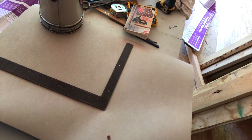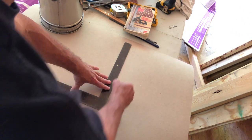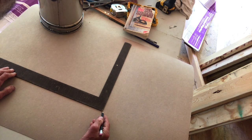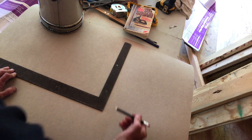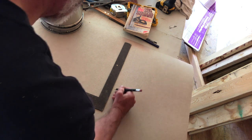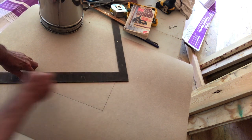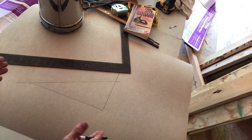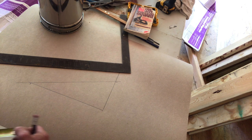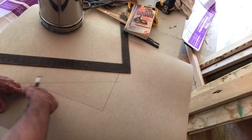All right, we begin with a piece of scrap paper or cardboard. Draw a line on your paper using your square. Mark over 12 inches — that's always 12 inches. Next, you want the pitch of your roof marked on here. In this case, I have a 6-12 pitch. I'm marking on the outside — I come up 6 inches. Now I'm going to take the square and connect those two marks. I want the radius of my hole: the hole needs to be 12 inches, so the radius is 6. I'm going to mark 6 inches — that's half of the diameter of the hole I want to make.